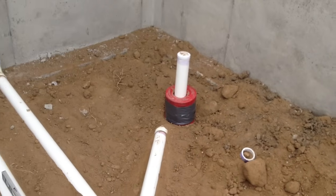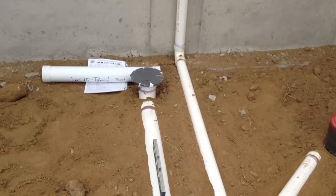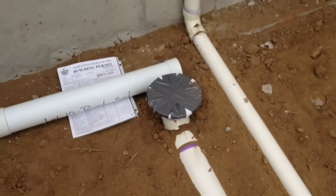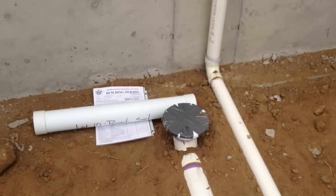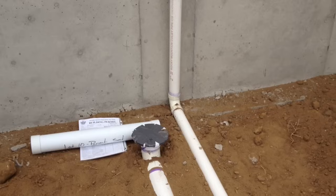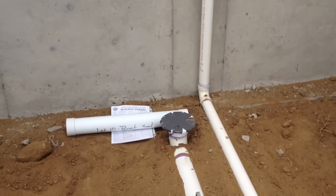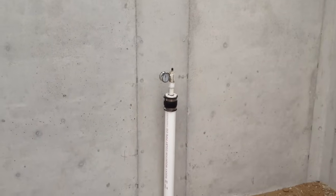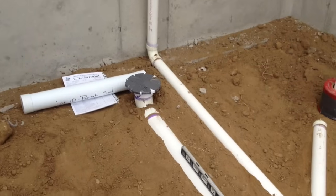The cement guys will actually frame a box around that most likely when we get to that point. Over here we have a toilet flange. That needs to be set 12 inches from your finished wall, and 15 inches left or right to anything else — whether that be the side of a tub, the side of a cabinet, or whatnot. I go 17 inches on mine. I like to give a little room; if you've ever sat on a toilet where your elbows bump, I'm a small guy and if my elbows are bumping, I know it's a problem.